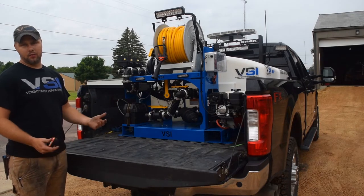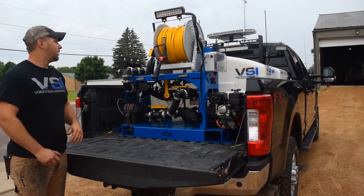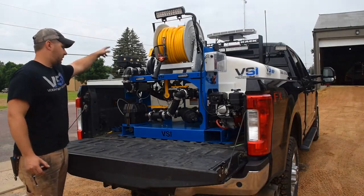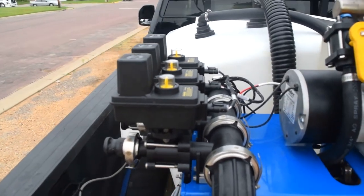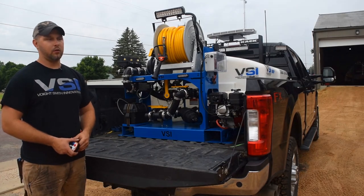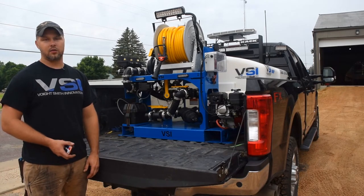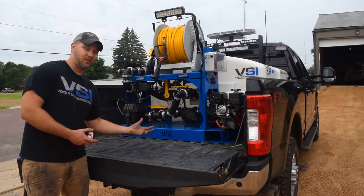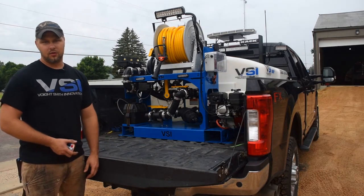The second upgrade would be the three-lane boom, like you see in most of our videos that we are filming. That is the boom nozzles out the side, the additional valves, the tips, everything — the hose sections that go along with it. Honestly, it is such an important feature that we were thinking about making it standard, but a little bit afraid of the sticker shock when guys first see the initial price without realizing what is actually coming with the sprayer itself. But the three-lane boom is a huge, huge advantage.